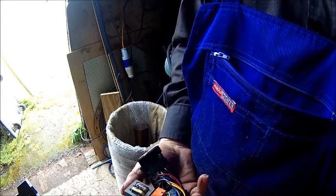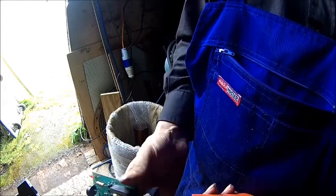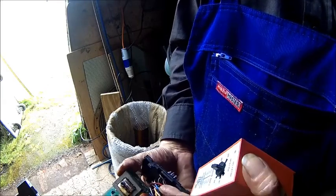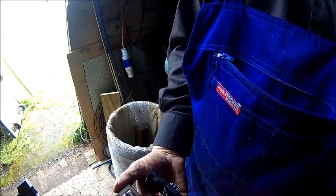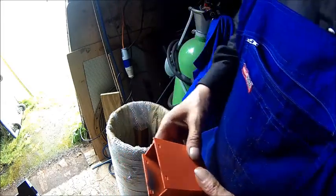So we need to figure out what the voltage is and see if we can find another one. I guess it's 24 volts — ah, there is something written on it. We need to replace that transformer and hopefully then it works again, because that is clearly shot here. There was a bit of a firework inside and it smelled funny.